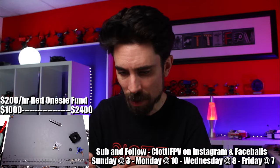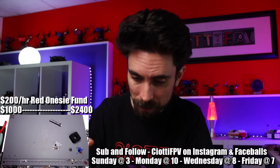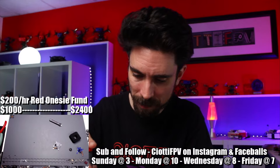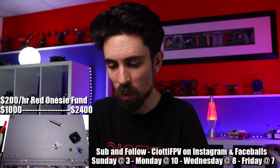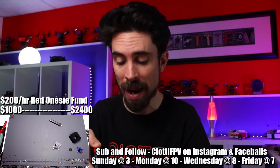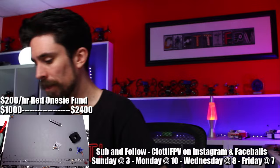The UFL plug for the antenna, the video antenna, sits right up on the front of the board. And so the front, if you run any flat mount, like most of these TPU mounts are kind of flat on the bottom, it makes the TPU mount kind of just sit up a little bit. And then what it's also doing is you're pulling the mount and the whole camera mount down into the AIO, which is not good. That kind of starts to hard mount the AIO, which is not great. So yeah, that's kind of annoying, but I've done it before and it hasn't caused problems.